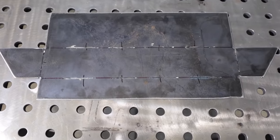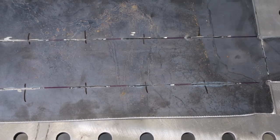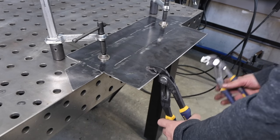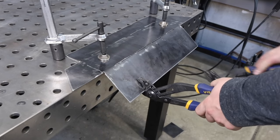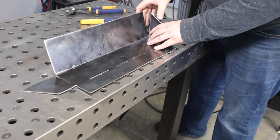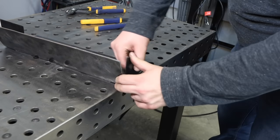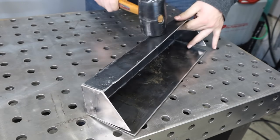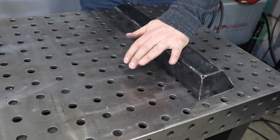You can see there are slots all the way along where I'm going to bend this into shape, and it's really starting to take the form I want. As I bent this I realized the slots probably could have been a little bit longer because it was still pretty rigid — I had to use a couple pairs of pliers and clamp things to my table to make the bends. But it bent in the right spot and formed together very much like I wanted. I just had to finish the job using a rubber mallet to get everything formed into shape.